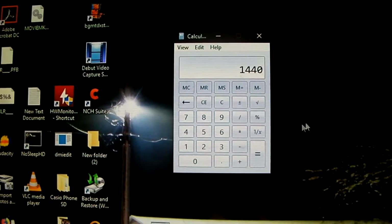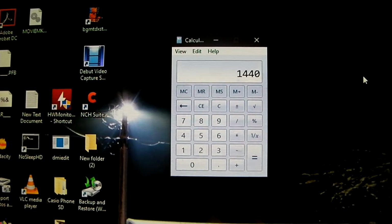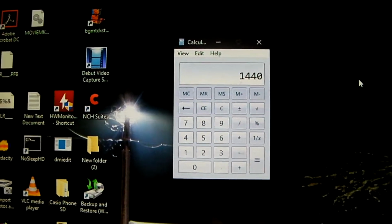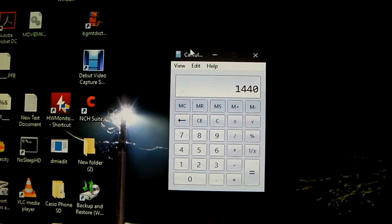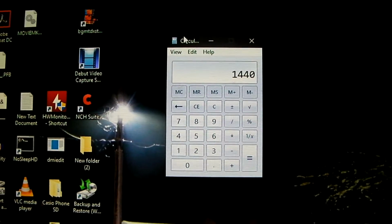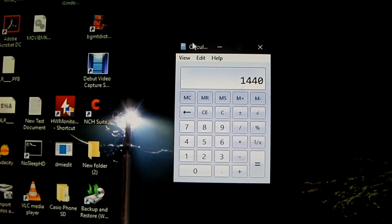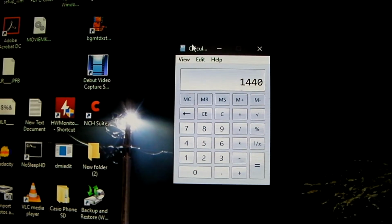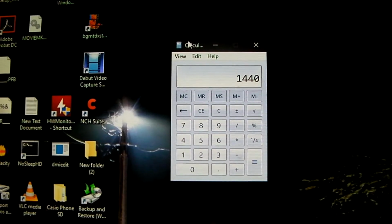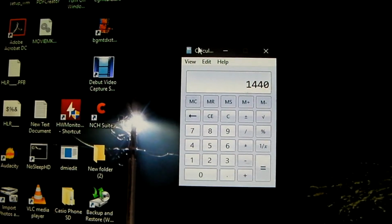So, on a 30-minute cycle, you would have 30 minutes of runtime and 10 minutes of defrosting. Now this is kind of a worst case scenario. Let's say the unit is running 24 hours a day. In many cases that wouldn't be the case, but if it's in the 20s or the teens outside and it stays cold throughout the day, and if the heat pump is not properly sized for the house, for any reason it has a hard time keeping up, it's going to run constantly.